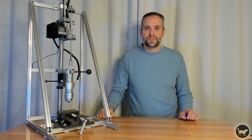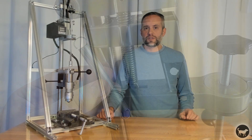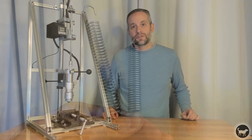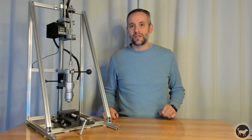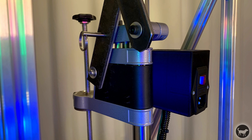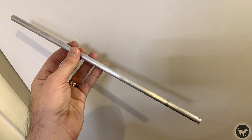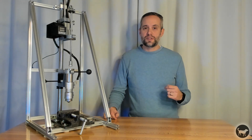Also inside of the top section, the springs that came with the drill press stands needed to be replaced with a more flexible spring. The original spring could not be extended to the full length of the pull without becoming stretched out. Since these springs are not as strong as the original, I wanted to make sure this handle didn't come crashing down on me. So I drilled a hole straight through the bottom section of the handle and into the top part of the drill press bracket. I then added a quick release pin that I use as a safety to make sure it doesn't come down when I'm not paying attention. I also added a 3/8 inch aluminum rod into the guide on the bracket to keep everything lined up, and used a clip from the guide that came with the drill press.